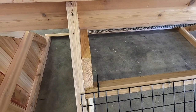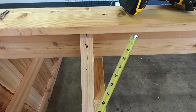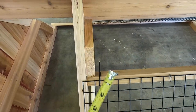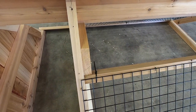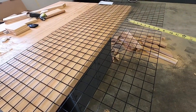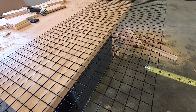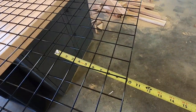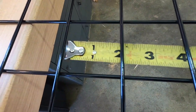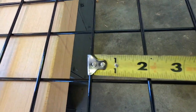As you can see, I've got different clothes on because it's a different day — I got pulled away from this project and I've got to get it done for my chickens. The next thing we need to do is measure from our top ridge to the panel we've placed temporarily — we're at 14 inches. So we need to cut our new panel: we need to rip it to 14 inches. I set my new panel on my workbench with six feet going this direction and three feet going this direction. Looking at 14 inches, I'm going to be right on this mark right here.